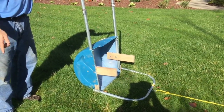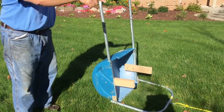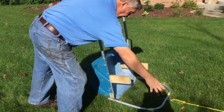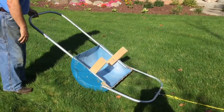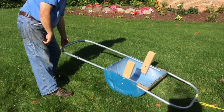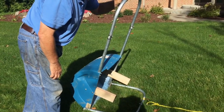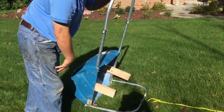Once you float it out to the lake to where you want to go, you go out maybe 10 or 15 feet further than what you want and then you just start to pull the rope in. As the rope goes in, the muck will be accumulating in here, and as it gets full you lean the back — now it's full — and you continue on up to the winch. When you want to dig down a little bit lower, if you hold it up like this it will actually dig in more because the cutting edge is down.